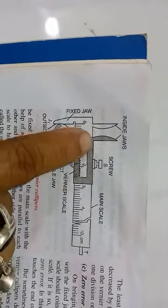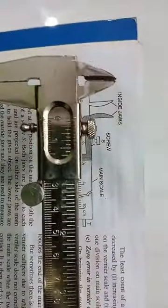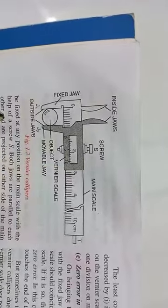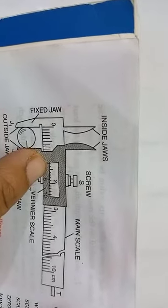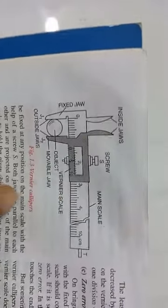And there is a Vernier scale also. This portion of the scale, which has been darkened in gray color, is actually able to slide on the main scale in the actual device. The second scale is the Vernier scale, and it can slide on top of the main scale with the help of a mover. So the first thing we have understood is that the Vernier caliper has two scales: one is the main scale marked in mm, and the second is the Vernier scale.